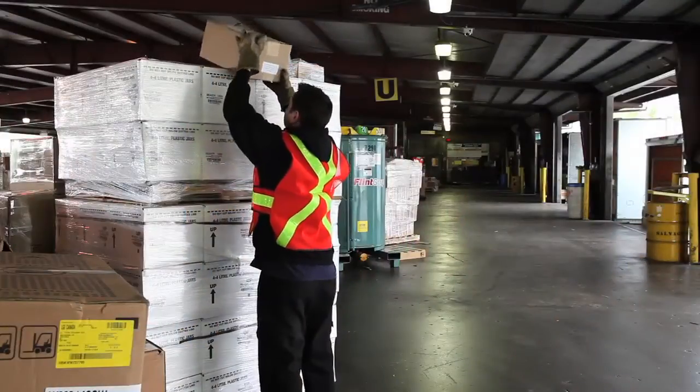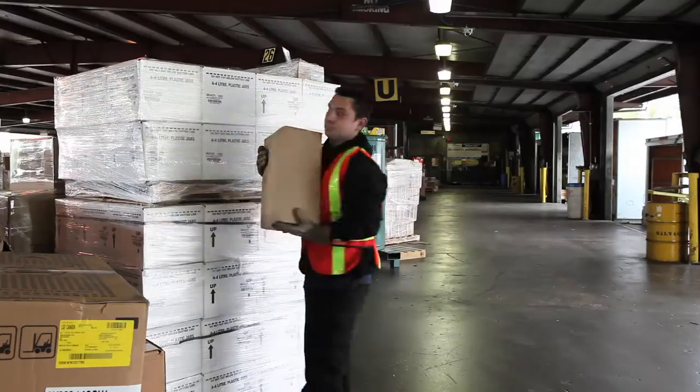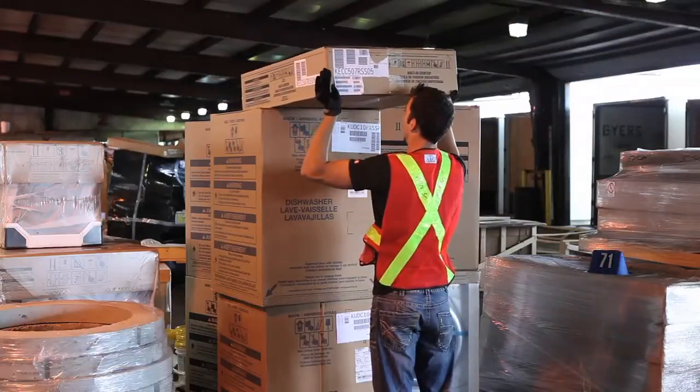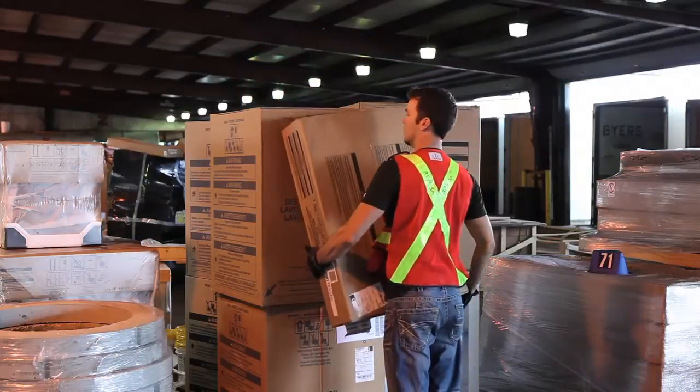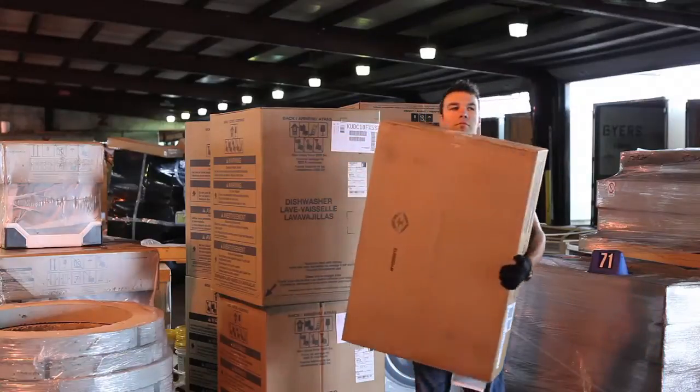Use good manual handling basics through the lift. Keep the normal curvature of the back, keep the load close, and don't twist. If you're moving something into an overhead position, get an edge in place on the high surface and slide and lever the load onto the surface so that you do not need to take its full weight.